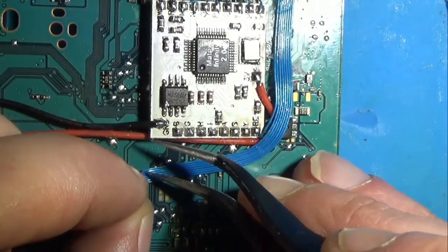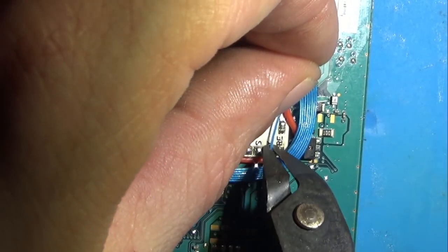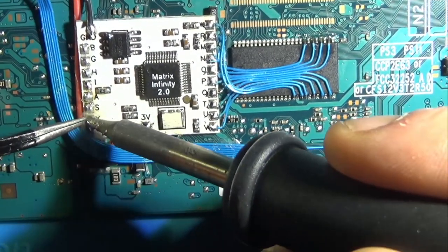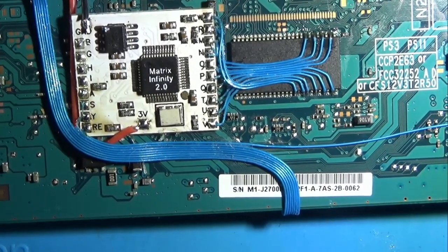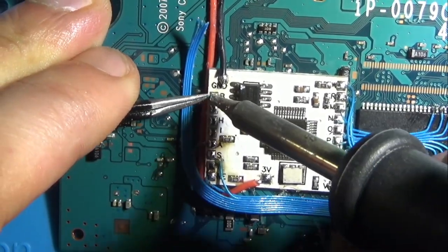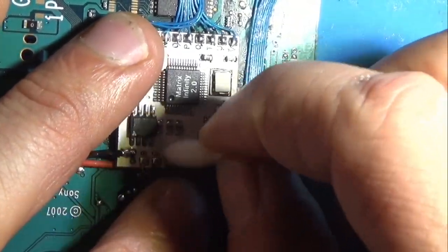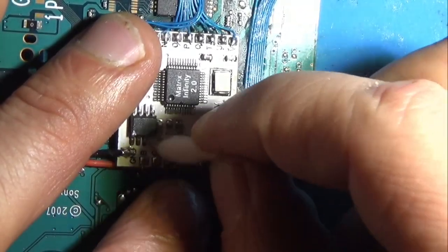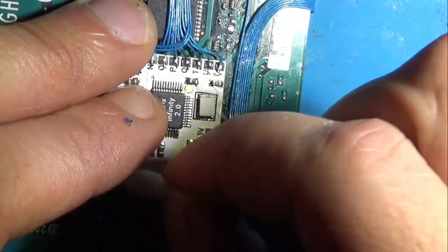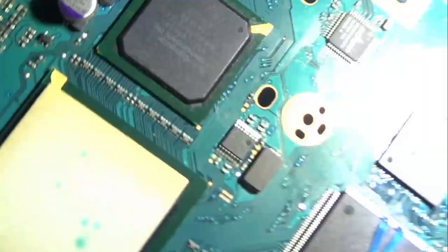Same thing here — lining them up, snipping it, soldering to the chip, easy peasy. The mod chip itself is being held down by a dab of hot glue on the back. As you can see, it's a little bit loose — I believe at the end I give another dab on the corner. Some IPA must have gotten in there and loosened it up. The S wire was on the wrong point, so I had to run it across like that from the front — not a big deal, hurts aesthetics a little bit, but perfectly functional.